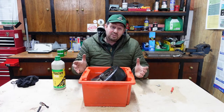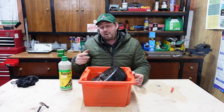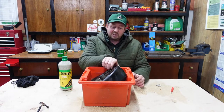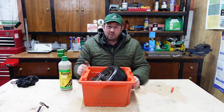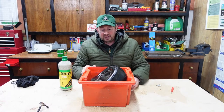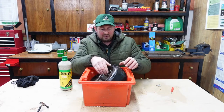Even if there aren't perforations in these mower tyres we still put a bit of this stuff in, because if we do get some punctures throughout the season it'll just seal them up as we're running along. The last thing you want is to be out in a field and one of these tyres comes off the rim — it's so difficult to get the mower back onto the trailer without gouging tracks in the field, and it just ruins your mowing day.